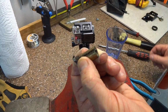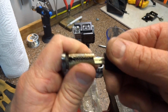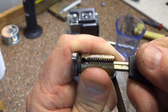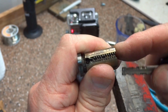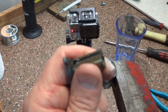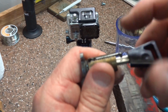So I wonder if we were to place that key in there, if it would still line up. It does perfectly. So there, let me zoom in just a bit so you can see exactly what I'm trying to show here. There's everything lined up on those discs, and then as you remove your key, some of them are not lined up, so that little bar will not go down inside of the groove there. But when we turn that key, everything lines up beautifully, as you see there, and that little bar does sink in and allow us to turn.